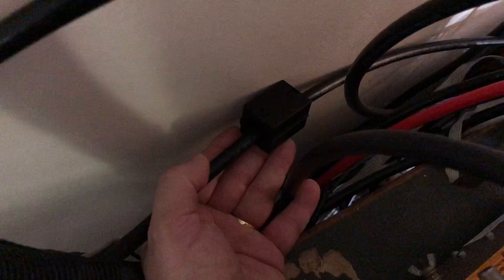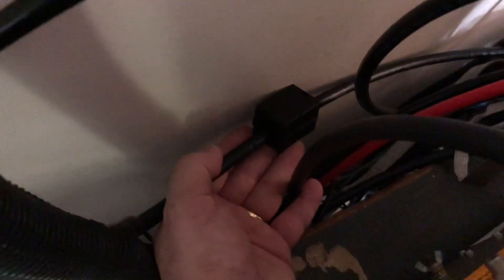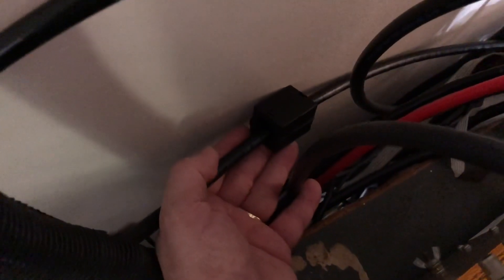I snapped another one — this one happens to be square but round inside — on the coax for the ZS6BKW, because it's a multiband dipole. That cable there goes out to my off-center fed dipole, and I've got it coiled outside with chokes wrapped around the coil.